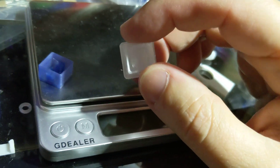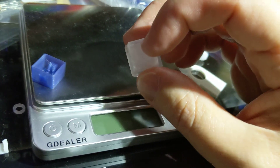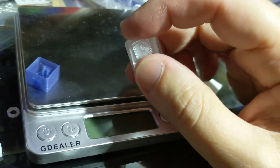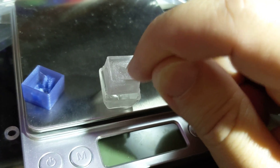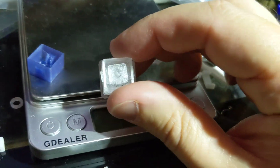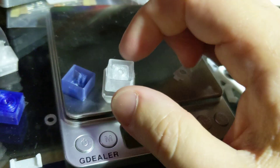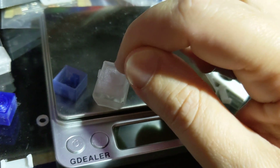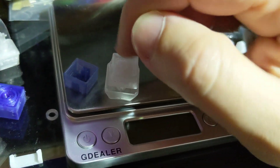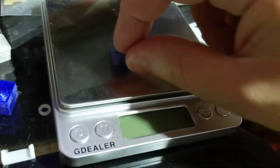For reference, the plan with that little thing there — that's just what holds the stem to the beam spring inside, that little square. I've got two options: they actually make little magnets that are that exact shape — squares with a 4-millimeter hole in the middle. So I could do a Hall Effect sensor and just put one of those little magnets on there. Or alternatively, I can print this little cover in TPU so it's got a little bit of softness, and then just put a piece of copper tape on there with two wires underneath, so that when it presses down, it bridges the two wires and forms a circuit.